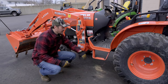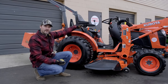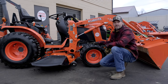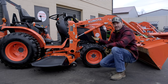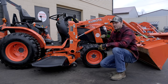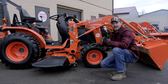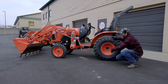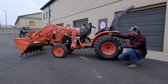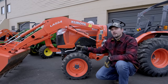Let's cover tires and dimensions. Both the Kubota B2601 and the John Deere 2025R are going to have 12x16.5 on the rear and 23x8.5x12 on the front — this is the R4 tread pattern you see on all three machines. You can also get turf tires, R1 ag tires, or a hybrid like the Versa-Turf or Goodyear R14 radial. Over on the Kubota B2650 you'll have a 12.4x16 tire on the rear — those rear tires are 36 inches tall, versus 32 inches tall on the B2601 and 2025R.